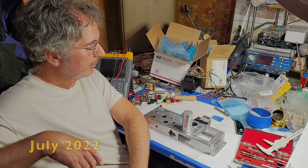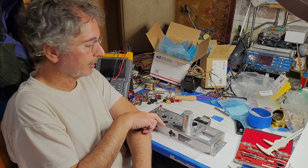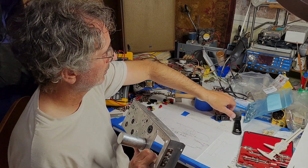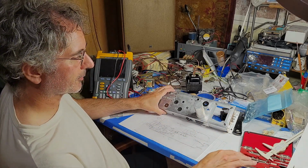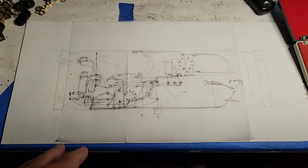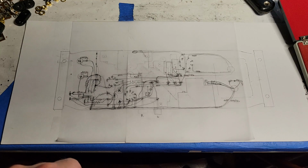Enjoy. I'm building this single-ended tube amp based on 6BQ5 or EL84 tubes for the outputs and 12AX7 triode tube on the inputs. I'll show you here, and I'll show you in more detail, the process by which I've laid out the amp using a few simple drafting tools for assistance. Morgan Jones suggests, rather than a circuit board type approach, a more three-dimensional approach, which can be, he cautions, a mess if not properly planned.